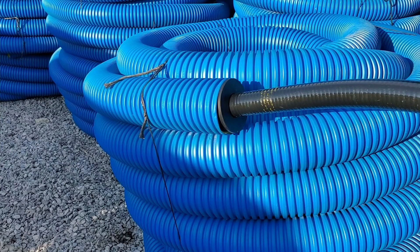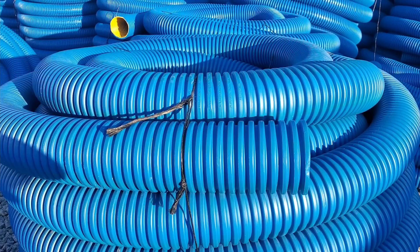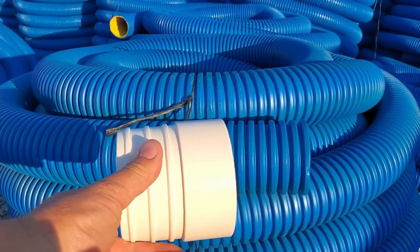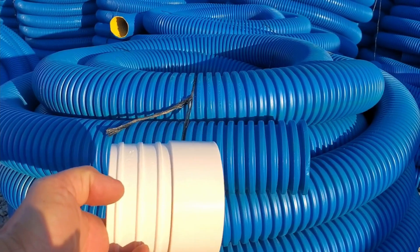Once you're at that point, just go to four-inch corrugated and send it — it's that easy. There's nothing more durable or lasting, nothing stronger than solid corrugated pipe. The French Drain Man's high-octane royal blue is manufactured by the Boffman Tile Company. Now let's go over a couple of beautiful couplers in the drainage world. How do you connect PVC pipe to corrugated? We make it simpler and easier. We have a four-by-four coupler, smooth on one side — we call it the cone.